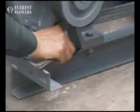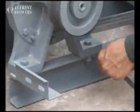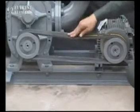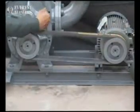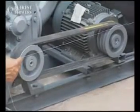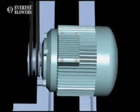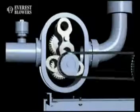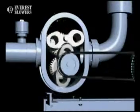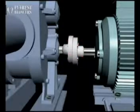Feet that are bolted down in a bind can cause distortion of the casing, disturbing the internal clearances. If blowers are V-belt driven, check the belt tension and alignment. Over-tensioned belts create heavy bearing loads which lead to premature failure. Misaligned V-belts can cause the impellers to rub against the side plates, resulting in overheating and jamming on operation. Misaligned couplings can cause premature bearing and shaft failures.